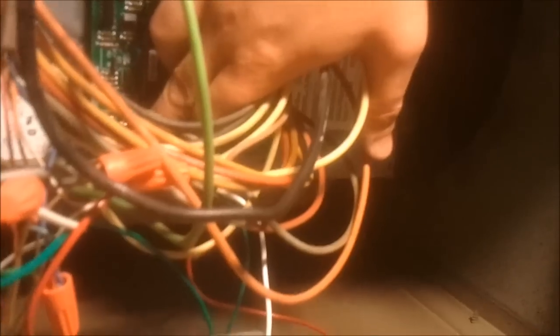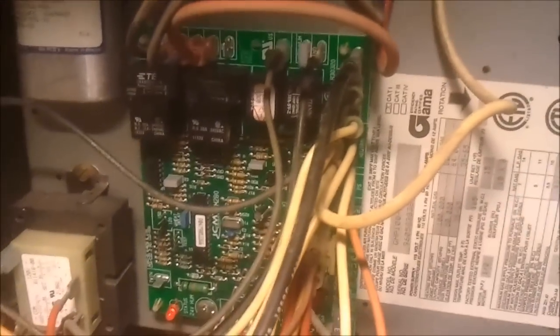We're going to reach up here and flip the switch on and see if the little red indicator light on the board turns on. Let's reach up here and turn our switch on — yep, we've got a red light! So of course now what we have to do is wait until the hottest part of the summer and make sure that the air handler continues to run the way it's supposed to and doesn't randomly shut off while the thermostat's calling for air conditioning.